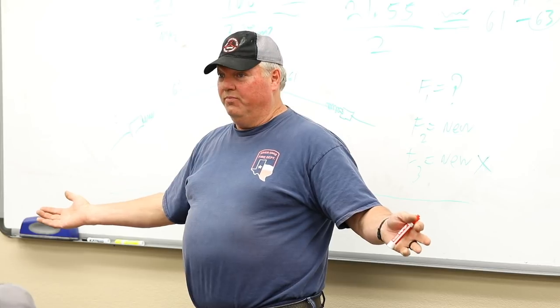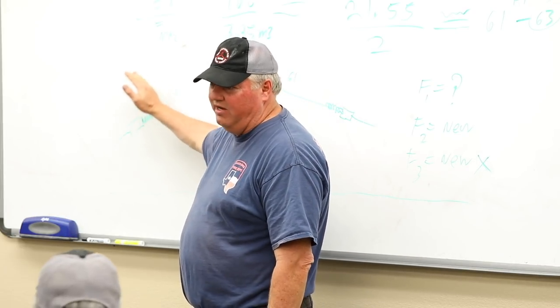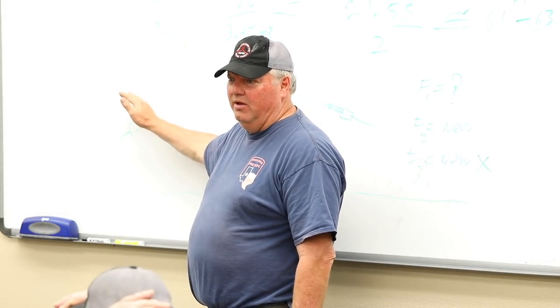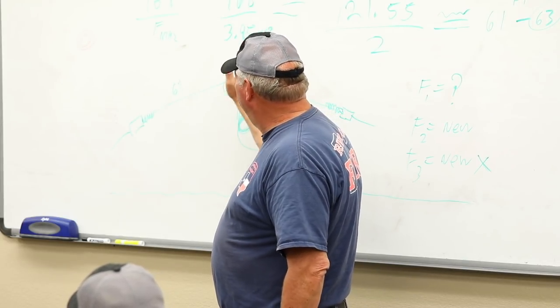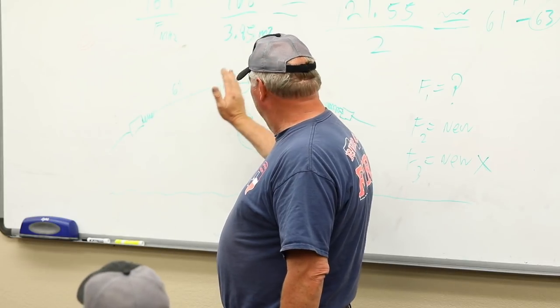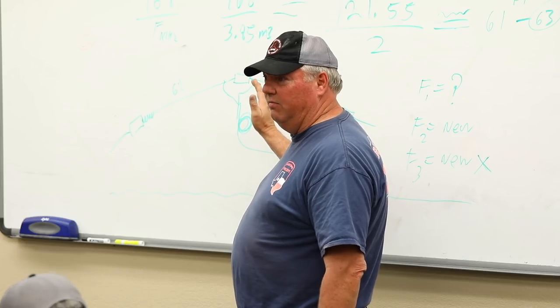It's a little more. And then if I want to go down to the CW part of the band, which is pretty dang far, I put my tuner back in and I touch it up. Because keep in mind, when you're on your resonant frequency, and I want you guys to hear this, when everything's resonant, everything's working, it's at its most efficient, right? And the losses in your cable have the least effect on your system.